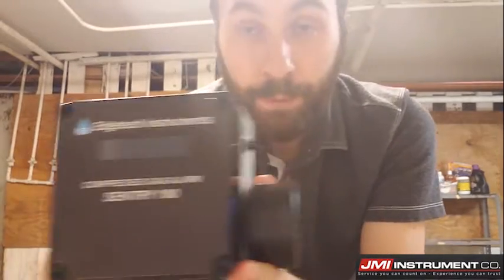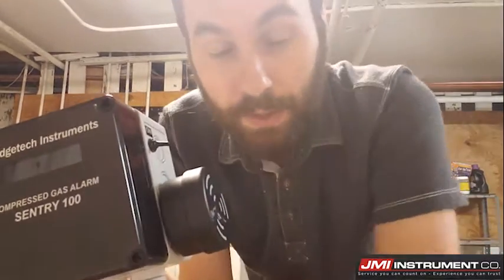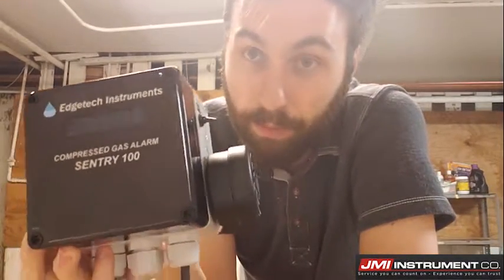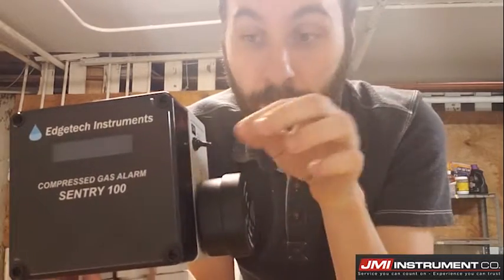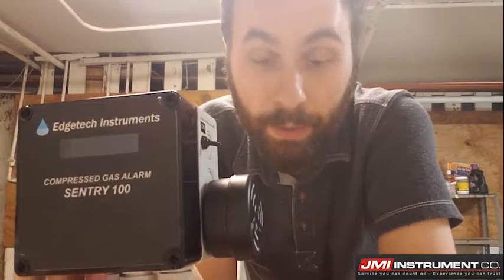Alarms, horns, and strobes. Different levels of horns. You got 85 decibels or 100 decibels. So whatever works best for you. This whole thing is optional. It's going to give you a 4 to 20 out. Here's the acknowledge. It'll give you a 4 to 20 out, or it'll give you RS-232.